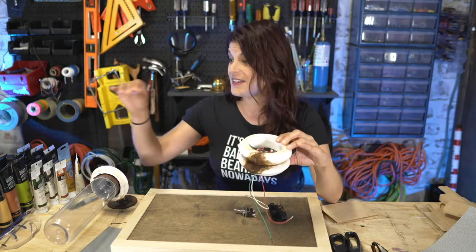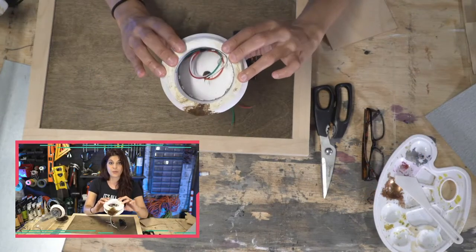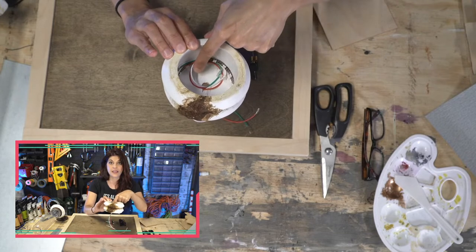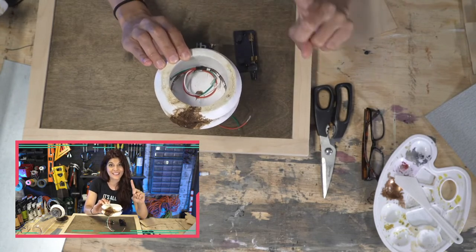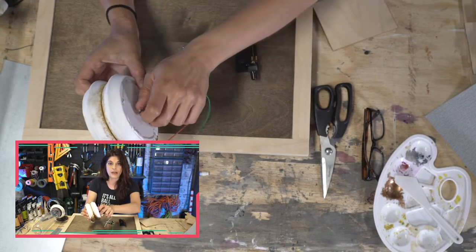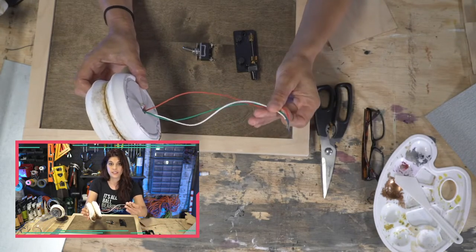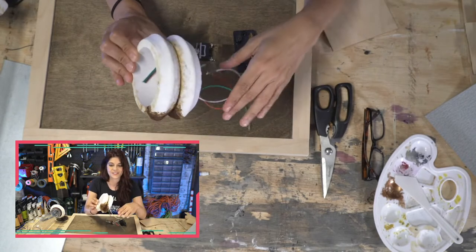So what I basically did was run to the LED strip, completely undo it, and grab its tail end, which has connectors, and then unravel from there, because I know that those LEDs are good. And I made a ring of LEDs in here, which are going to come out this side right here. So here we have our power, ground, and signal that's going to feed this ring, and we can make some cool color combinations with it.